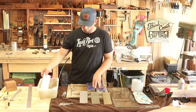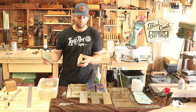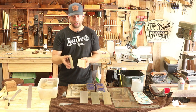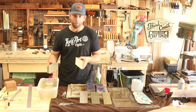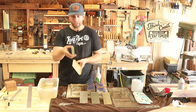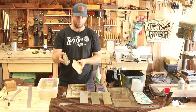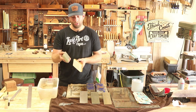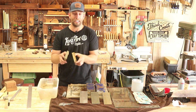When I first bought my sharpening equipment, I started off with some double-sided stones — I wanted to get as much bang for my buck. I got this 220 and 1000 grit Norton stone and this 4000 and 8000 grit Norton stone. The 220 side I determined right away wasn't very good — it's really soft and doesn't abrade very fast. The 1000 grit is actually pretty good, but what I use this stone for nowadays is just flattening these stones.